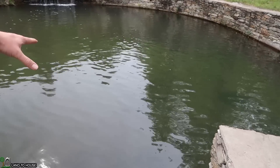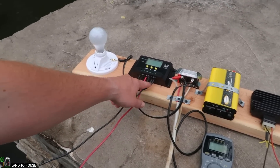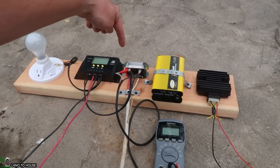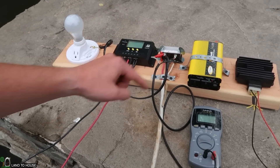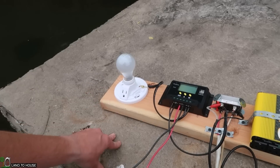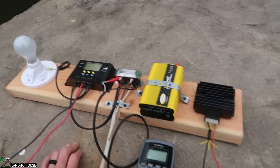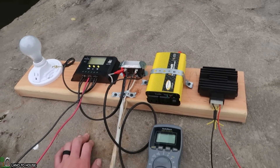So we've learned some fun information: 45 volts open circuit with a straight pipe, and that's probably what most of our testing will be around for the rest of the video. We have enough water to run this thing for at least 20 to 30 minutes. For the next video, I believe we're going to hook up a battery to the charge controller — it's got a dump load over here. This rectifier will bring the three-phase in, give the charge controller DC, which will read the battery and charge it. Once it's full, it will provide a dump load to a 100-watt bulb. We can hook this up to the battery and pull off some kind of load and see how many watts this thing is producing while charging that battery.